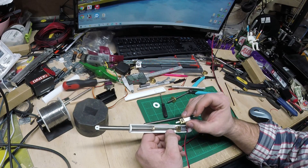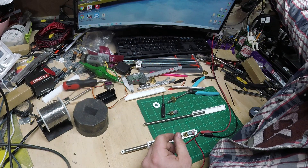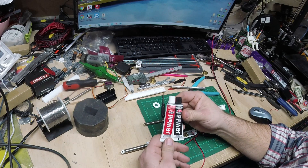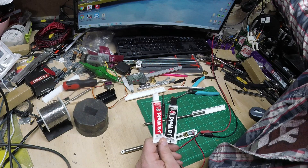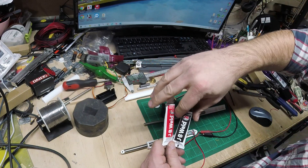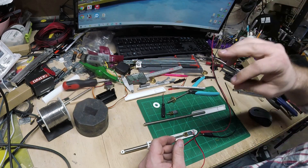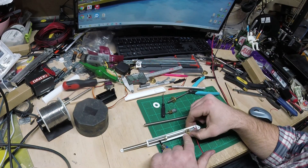Once I drilled the hole and put a little bit of JB Weld in there - if you're not familiar with JB Weld, it's just a two-part compound, part A and part B, a straight 50/50 mix. This is made for steel, for plastics, for stuff like that. Put that in there, it'll kind of set up and get hard in about four to six hours, then let it cure overnight. Really happy with the way that turned out.